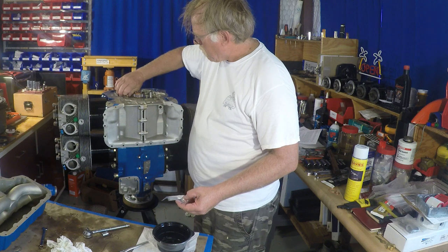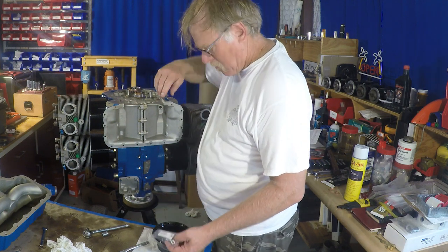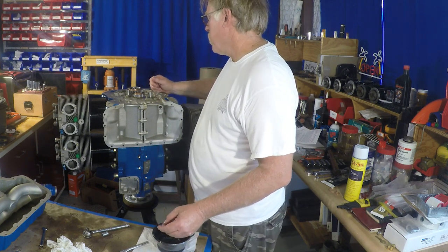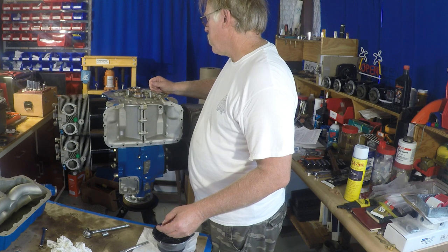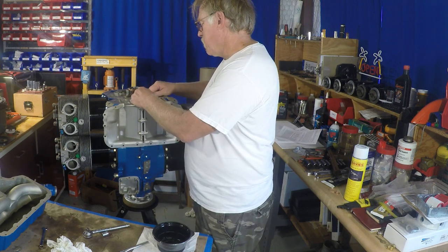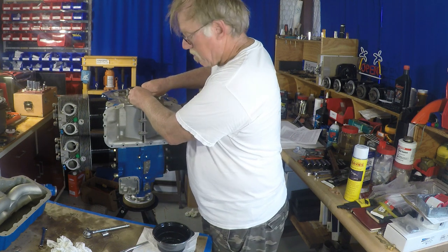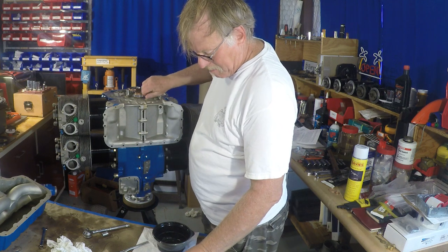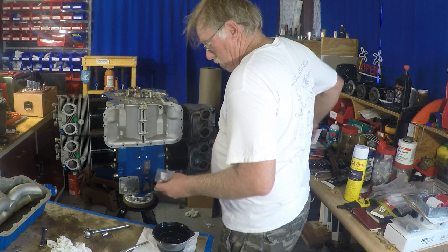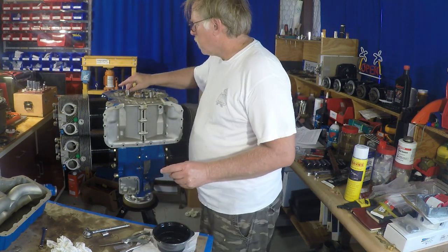The other thing that's important is when you're lubricating this hardware, especially if you have a closed cavity where that bolt goes in that's not open to the back area of the case, you don't want to fill it with oil, because then you can actually hydraulic lock that bolt and break things. So most importantly, put enough lubricant in, but don't have it swimming. This is the one nut.